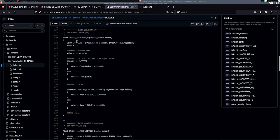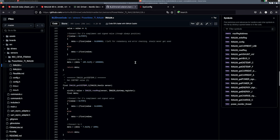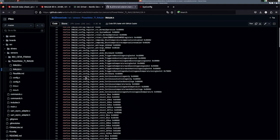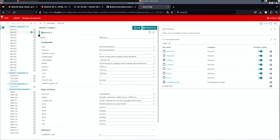In order to write all of this yourself would be too much work, and if someone is spoon-feeding you this information, you should take it. There are also all the registers and their values, all given to you. I highly recommend if you're using this module, use the sysconfig interface that Texas Instruments provides for free so that the majority of the heavy lifting of writing the device drivers is already done. All you have to do is interface it with your MCU.